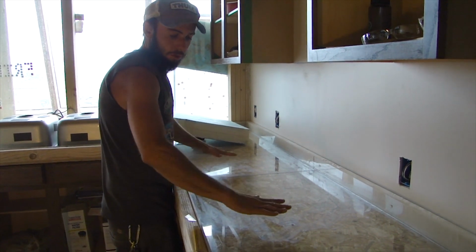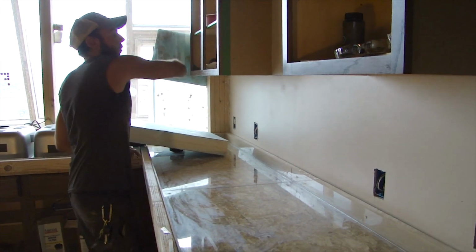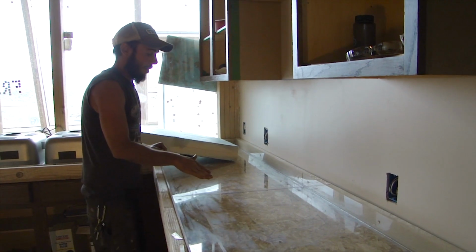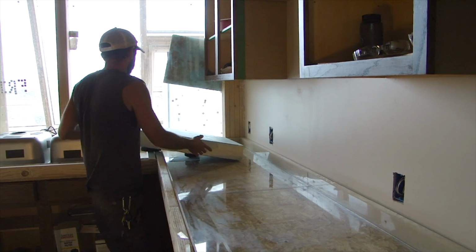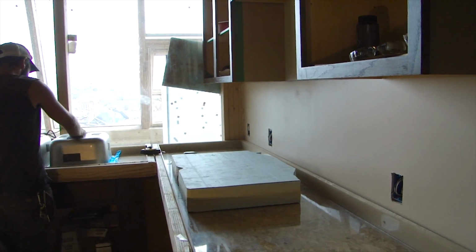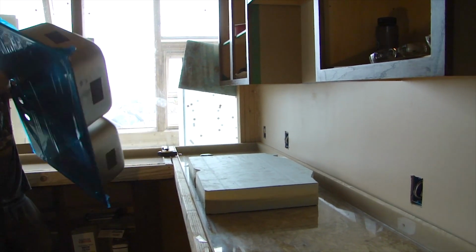Remember, up is the bottom, and the bottom of this form is the top of the countertop. So the whole countertop is going to get flipped over this way. That's why this 54-inch to center of sink measurement needs to get pulled off of this side of the countertop form. So I have that center mark here, and also I'm positioning my form like this, shaped like that, because the sink here, I'll show you. Come over here.